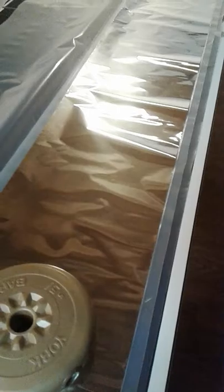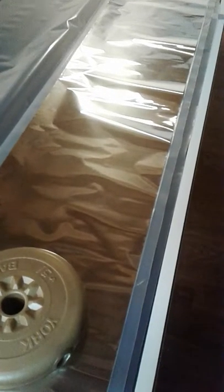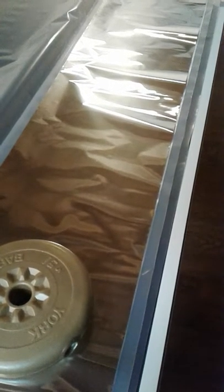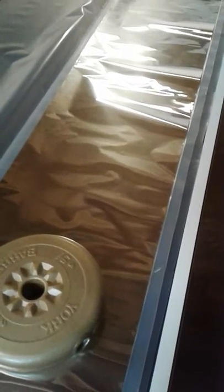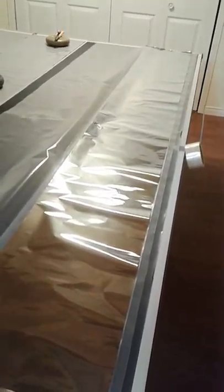Capacitors, if you build them good, can take a bit of hits through the insulator and actually heal themselves, especially depending on the special insulators you're using. A capacitor can take half a million hits before it actually shorts through and burns itself out. They're really tiny pinholes that it makes, and it doesn't usually damage the capacitor until the holes get really big. A lot of times it can heal itself as it creates a hit through the insulator.